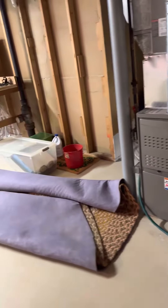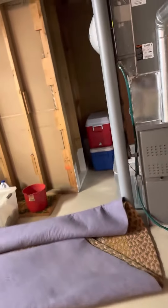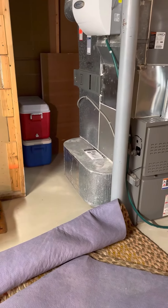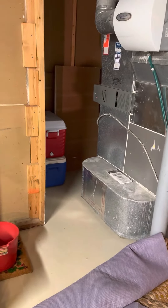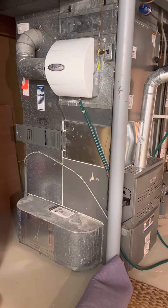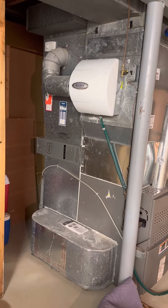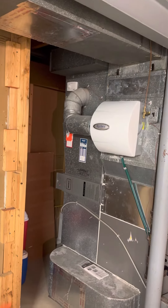We're in a basement, focused on the AC and coil — having some issues there. I'll give options for that and also for a new system. It's a little goofy how this furnace has been set up, and the size of the furnace looks way too big. There's a six-inch flue coming down with a wrap around on the back, and there's a support beam — that may be why the furnace is configured the way it is. If we take everything out, we'd probably want to rotate that furnace around and then have the return on the left side.